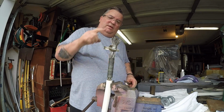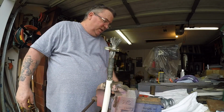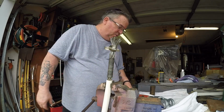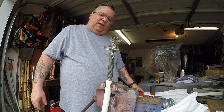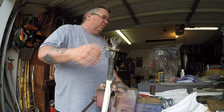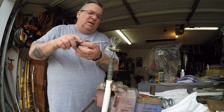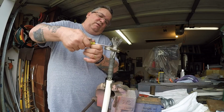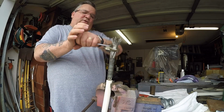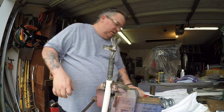Remember, until this is inside of this, you have to take extreme care in keeping everything that touches these broomed out filaments clean. No grease, no oil, no dirt, dust, anything like that. While I was getting ready to put these together, I had them all covered with big plastic bags so that no dust could get down inside. If I was only making this for myself, it wouldn't be that bothersome, because I would always have a little bit of caution in my mind.